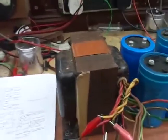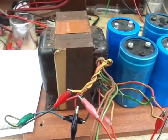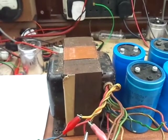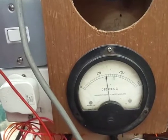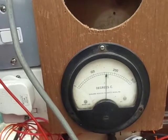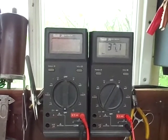Loads of people on YouTube will say don't do this, but you've got to learn. Obviously don't touch any wires, make sure there's no shorts, monitor the current and you should be alright. That's sounding better — we've got no current, 100 volts... 150 — that's about 10 volts out. At 170 volts there's the secondary output: 36 volts.